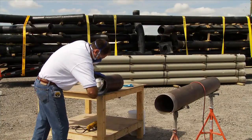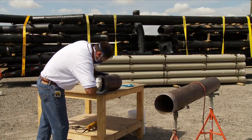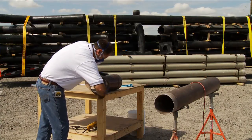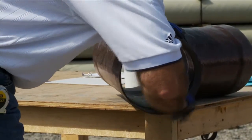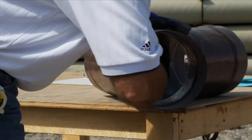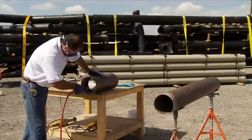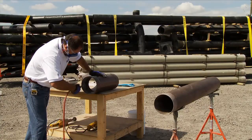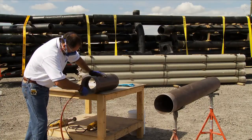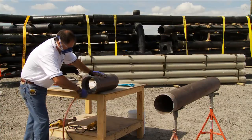It's also necessary to sand the inside diameter of the fitting socket area. The fittings come pre-sanded from the factory, but because they may become contaminated while handling, it's recommended that they be resanded. It takes a few minutes to hand sand these areas with emery cloth. To speed up the sanding of these areas, it's helpful to use a power tool. Die grinders are available in electric or pneumatic, or a drill can also be used, but will take longer as mentioned earlier.